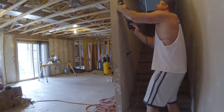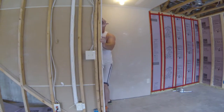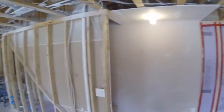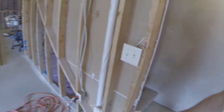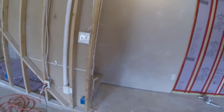After trying to take this corner apart, this ain't gonna come off easy. I'm actually gonna just remove this stud entirely and just replace it because I'm not gonna mess with trying to take that sheetrock off piece by piece. There we go, we got that stud out. I'm gonna screw the sheetrock into this board, trim it, throw another stud up against it for the new piece to butt up against there as well, and we'll be good to go.